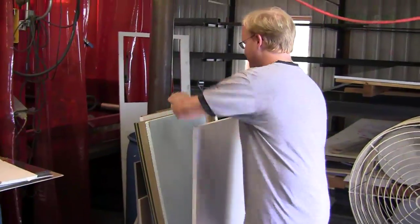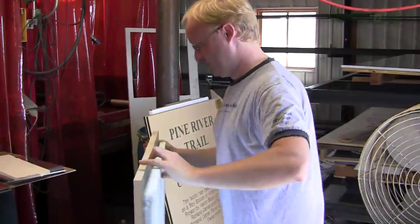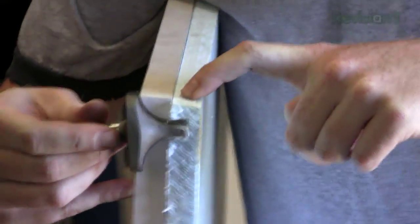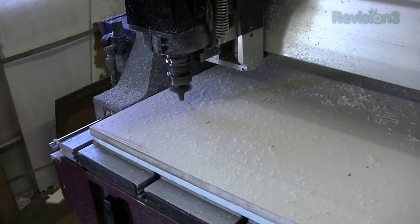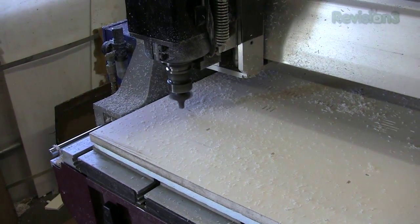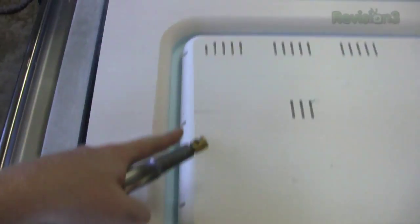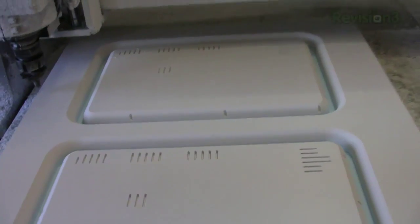The problem is the material is three-quarter inch but the bit's actually longer than that, so it would dig into the table past this edge. To solve that problem, we're going to use some cheap sacrificial foam, tape it to the material you want to cut. That way, when the bit cuts all the way down, it just feeds into the sacrificial foam and the table will be safe. As you can see, the bit went down into the blue sacrificial foam, giving us a great nice curve around each of the pieces.